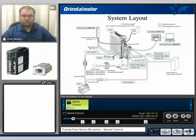The system layout is shown before you. We would see the motor with the encoder connection cable, the power motor connection cable, digital I/O port CN7 which would accept pulse and direction or on-off signals, and analog port CN6 where you would send your 0–10 volt signal for systems such as speed control or torque control.